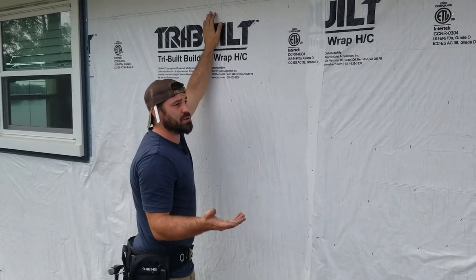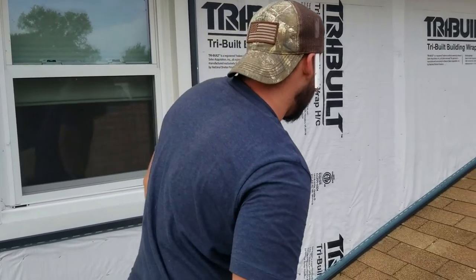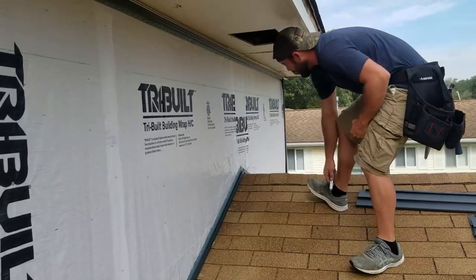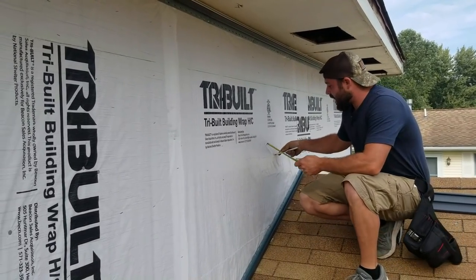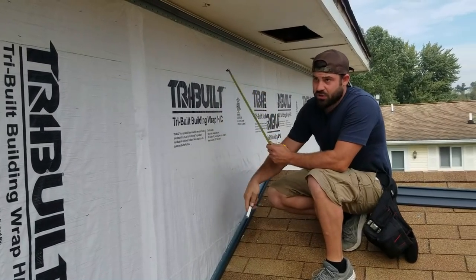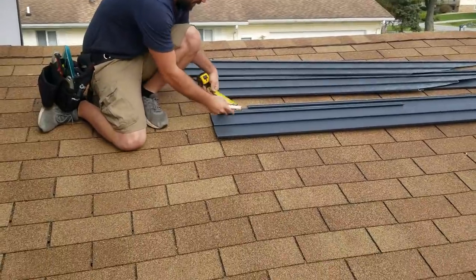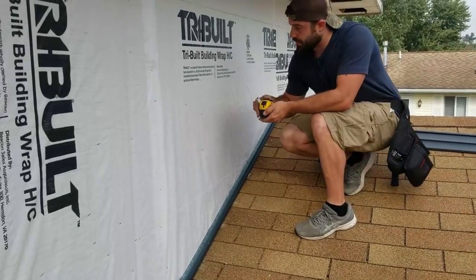And what else we can do to really help these pieces meet up, let's say, for example, the video might still be going. I'm not sure exactly what's going to happen with this video, but as you can see, it's going to be one of these pieces here that's going to come across and have to meet up there. So basically what we're going to have to do is, let's say our seam, or the top of our siding, is running somewhere over here. We'll pull down. We're going to be making sure this entire time that our reveal lands on this, but what we can do is add an inch and a half from the reveal. 9.5 tall. Yeah, from the reveal to the flange.